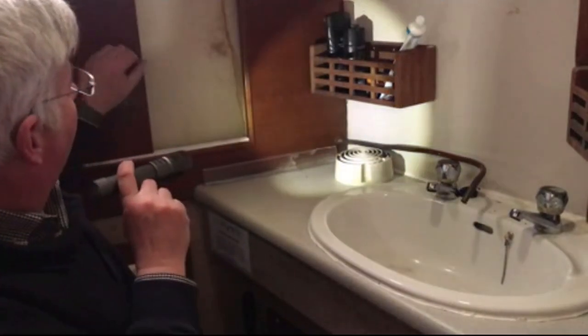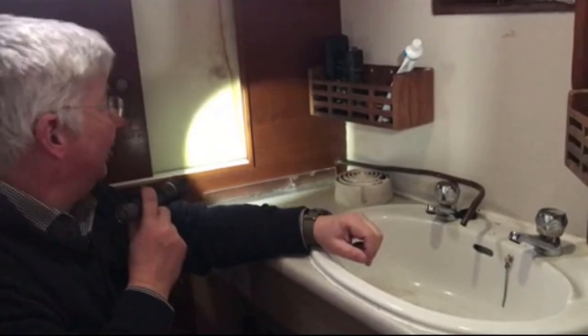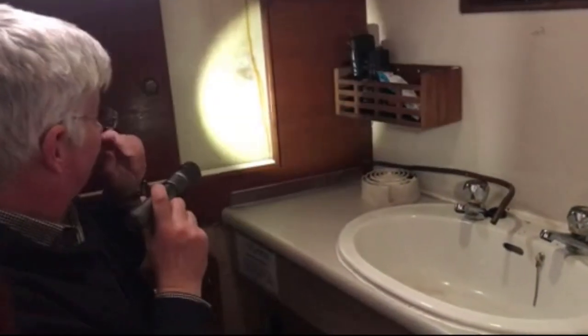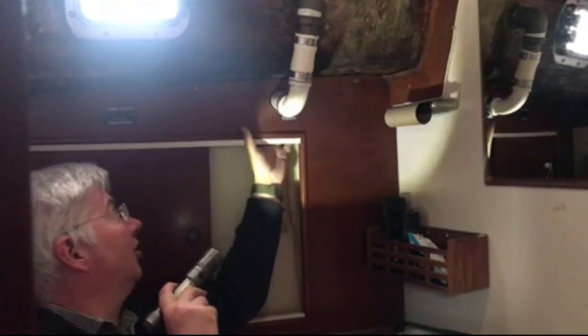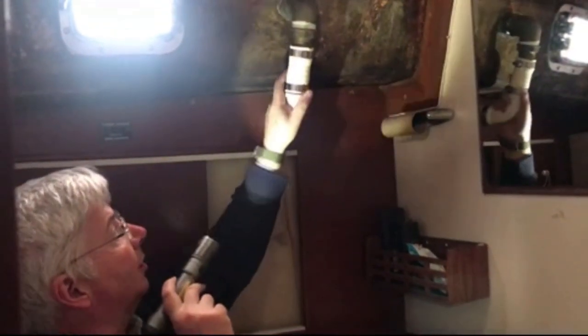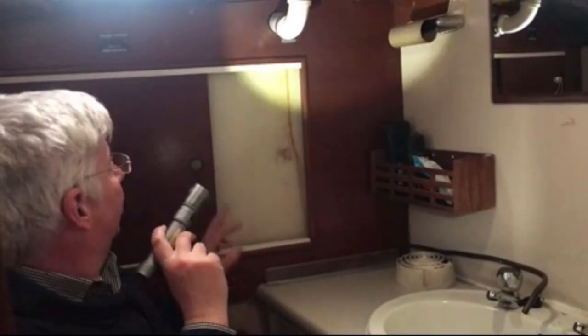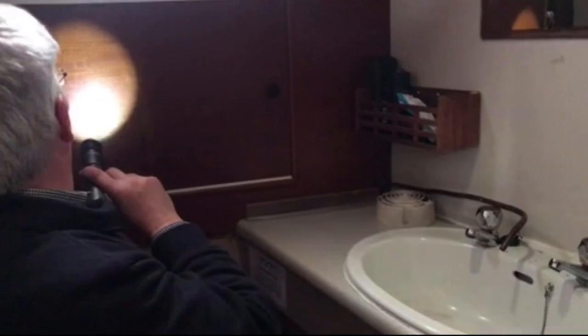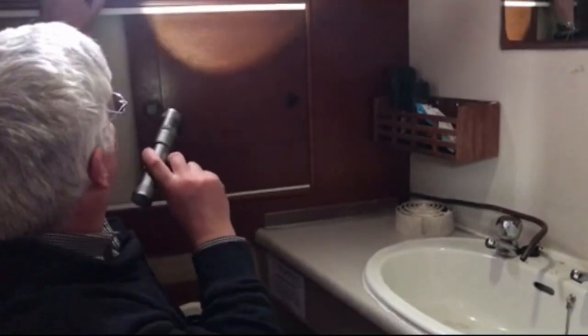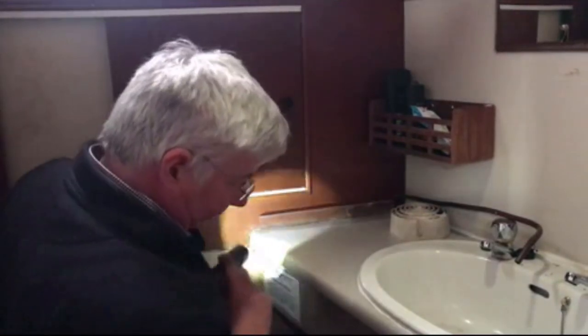Not a great deal of room in this cupboard. The holding tank connection here is very Heath Robinson — if that's the pump-out for the holding tank, or possibly a vent, it's quite ugly and obtrusive, taking up the whole cupboard. I can't close it to see the hoses, so I can't see if the hoses go into a high anti-siphon loop or not — all I can do is feel the hoses.